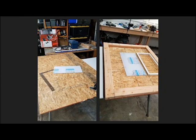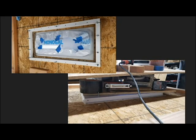Making the door was the hardest part. The door is going to be big, heavy, and has to serve a good purpose. I got two sheets of quarter inch polycarbonate — one by two foot — and I had the submarine porthole plan in my head. I measured where that would sit based on my eye level so I would be the one peeking through to see everything being done. It is sandwiched between other pieces of wood, and each layer inside the door is silicone sealed. I put tons of weight on it and let it dry overnight each time. That's a one inch gap inside two layers of quarter inch polycarbonate — I was instructed this style is more effective than having a half inch or more of solid polycarbonate.